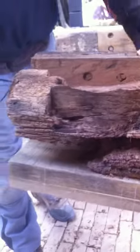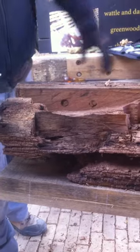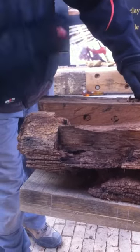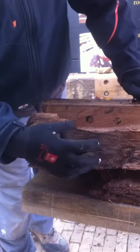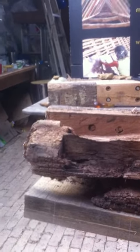If you come round further, you'll see that we've also got a brace mortise, the outer face of which is completely missing and worn away, decayed away. So taking out this large slab will give us room for some fixings. We should be able to fix into this wonderful strong piece of timber that remains on the other half of the jowl post, and we'll then be able to cut out a completely new mortise that will take our lovely curved brace that runs across the first floor elevation.